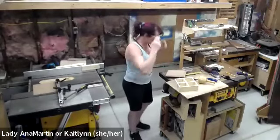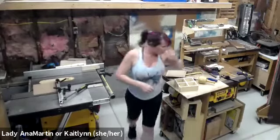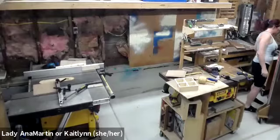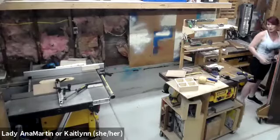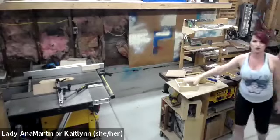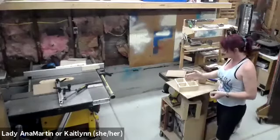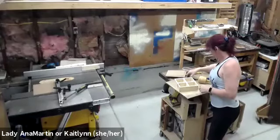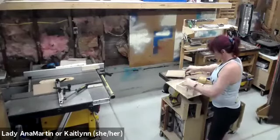All right. So the last step in our little torsion box here is to mark the internal dividers. If you were going to make a table like this, you would make many more of the internal dividers. And they don't have to be cross-lapped like these. They could be staggered and screwed or nailed in. Oh, right. I'm marking. I'm getting ahead of myself.